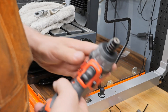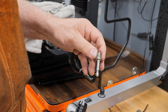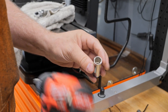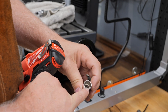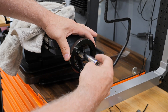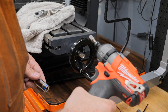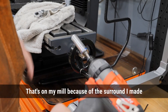The next part is how do we attach this to that. What I'm going to use is a 3/8 inch socket adapter — that's held in there tightly — and a 13 millimeter deep socket. It's the kind that has 12 flutes, 12 sides. The point of that is that if it has six sides you've got to find one of those six sides, but if it has 12 you've got twice as many positions so it's much easier to put on. That's important because you've got this in your hand and especially on the top z-axis it's not as easy to spin the whole thing.